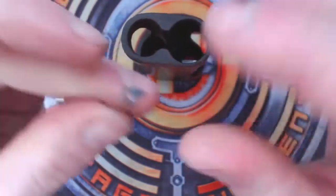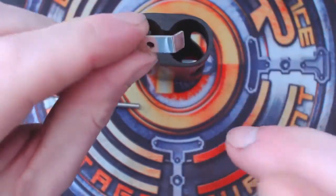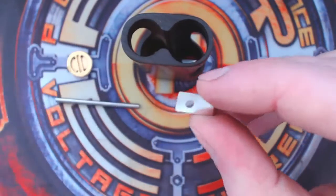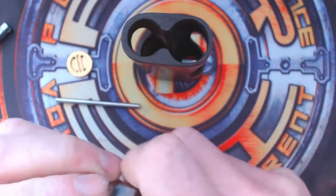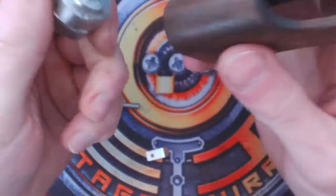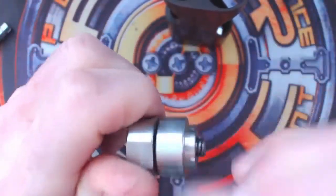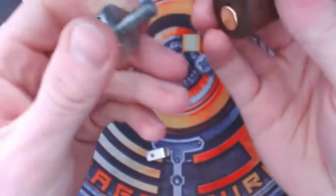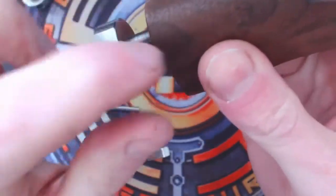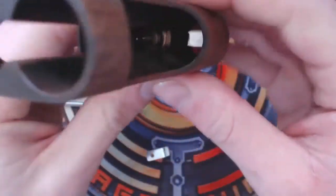The next and trickiest bit is putting in the silver contact — it's got a bend in it and a small hole, and it needs to go in with the bend facing upwards. Get your 510 tool and take off the bottom nut to give more travel, then screw it into the 510. That depresses the 510 core on the spring-loaded section until it stops, basically bringing the center pin up more.